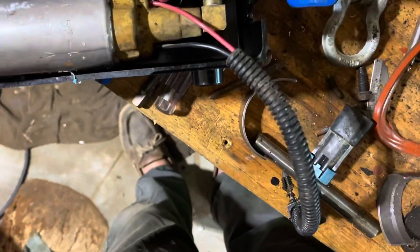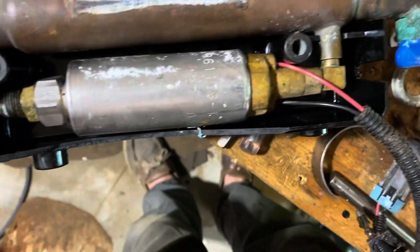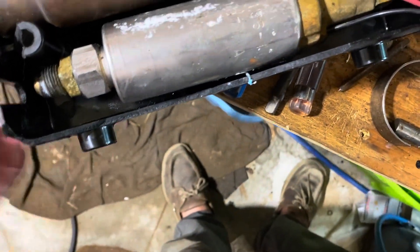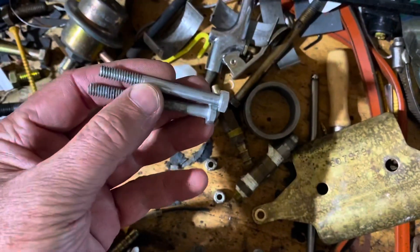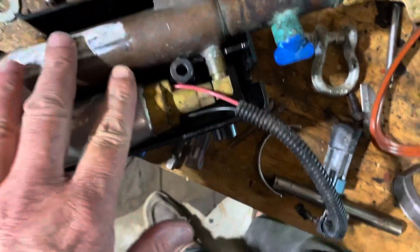To fix that, I drilled all the way through the plastic housing. I'm going to clamp it all together with quarter-inch bolts - they've got a shallow hex head and they'll stick in from the bottom and come out the other side, holding it all together. By the way, that's not stainless hardware - this is temporary. I'm going to get stainless quarter-by-20 screws and nylock nuts with the proper stainless hardware.